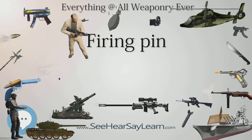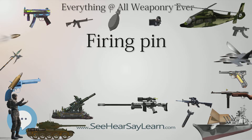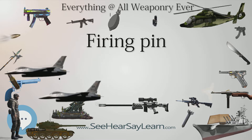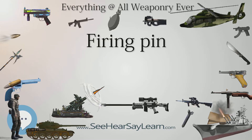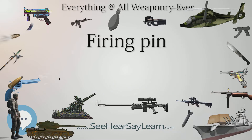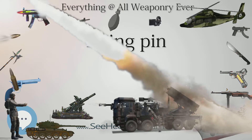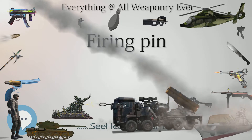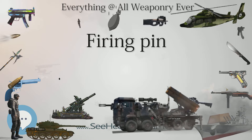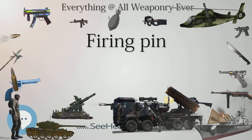Firing pin construction: The typical firing pin is a small rod with the end that strikes the primer rounded into a hemispherical shape and hardened. The rounded end ensures the primer is indented rather than pierced, as would happen if the firing pin were sharply pointed. Most firing pins have a spring to push them out of contact with the primer, and often will have an integrated passive safety mechanism, such as a block that prevents them from moving forward unless the trigger is depressed, or a transfer bar, also trigger-actuated, that must be in place to allow the hammer to depress the firing pin.